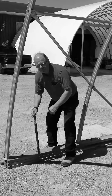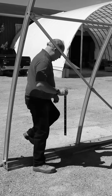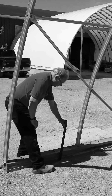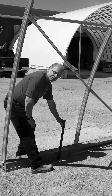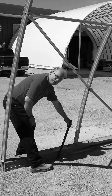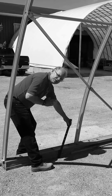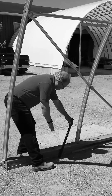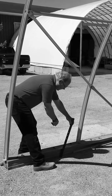To do your second post, you turn the opposite way. Again, you put the post in, turn it a little bit so that the leg is brushing against it, and lean it away from you. Each time you're doing this, you're leaning the post away from you. Then you hammer it into the ground and fasten it.